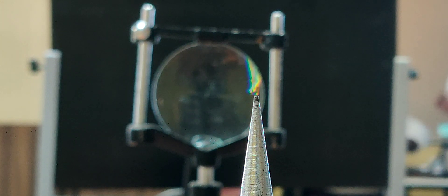The tips have got coincided at the left edge of the lens. At the center of the lens there is still a slight difference, so by using the knob you can again make the adjustment — they will again coincide. Now move your eye to the right side again; there is a small gap, and by moving the pin front or back you can fill it up. Again the tips are coinciding — at the center they are coinciding, at the left edge they are coinciding. So like this, they should coincide at both the edges of the lens as well as at the center. If they coincide at the center and both edges, it means the parallax has been removed. The tips are now moving without getting separated.